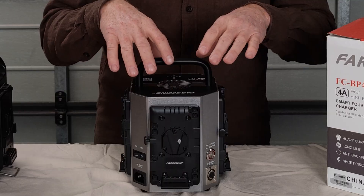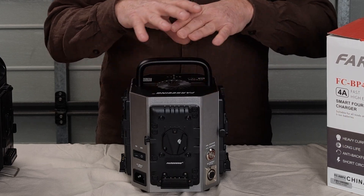Now there are different types of lithium-ion cells, so not all batteries are equal. If your battery is below 12 amps, or below three times the amp output of the battery charger, check with the battery manufacturer first to see if it's okay to charge them rapidly. Worst case scenario is over an extended period of time you might reduce the life cycle of the batteries — so instead of lasting seven years they might only last five. If you've got an expensive battery you're probably okay, but it is worth doing a check.